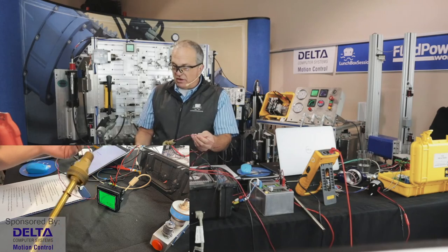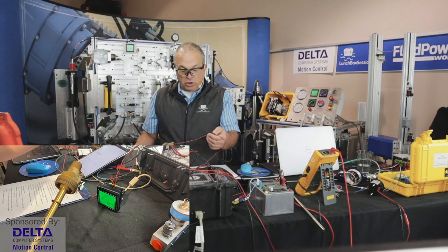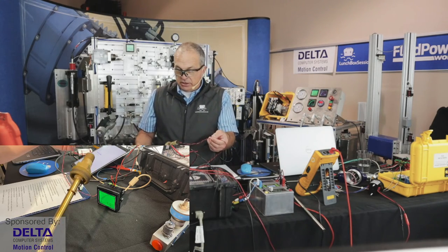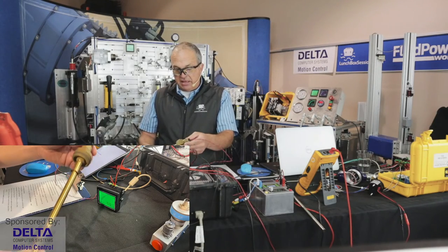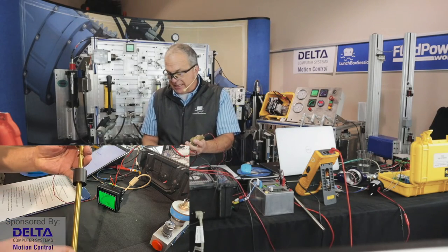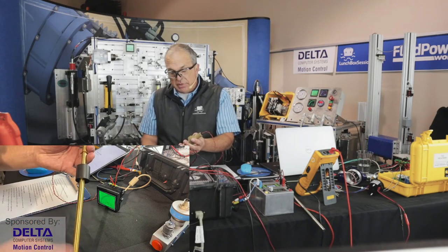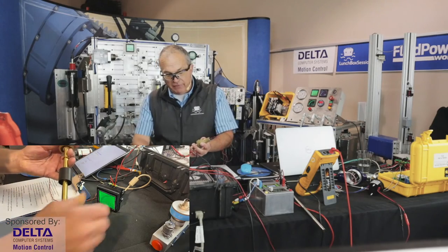Not a lot of time to cover that entire concept during our live, but if you know or look up what a 4 to 20 milliamp instrumentation control loop looks like, then you'll see it's based on just two wires. And this is from GEMS. It's an XT800. We like this one. It's a series of reed switches inside the hollow tube, with each reed switch with a resistor forming a large voltage divider on the inside.